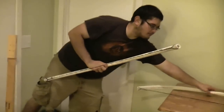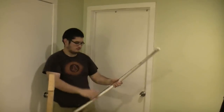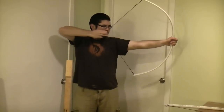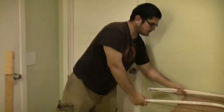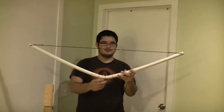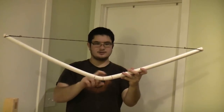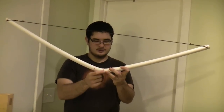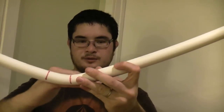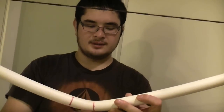So I'm just going to pull them out to full draw so you can see. One thing I want to add is that in all of my videos you'll notice I don't make bows like this — I always put some kind of flex into the handle. The reason why is because if there's enough of a forward flex here, it kind of lessens the effect that this hard bend will have. So instead of it bending really hard in the center, this curved piece will flex out a little bit and it'll have a little bit of give to it, so this is minimized. Still the idea is the same.